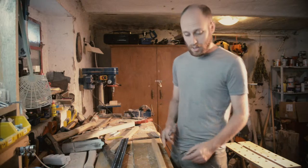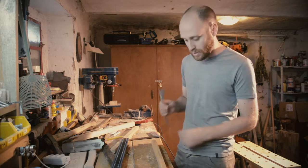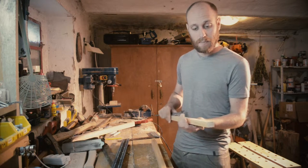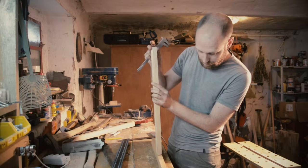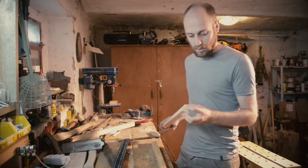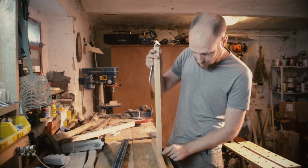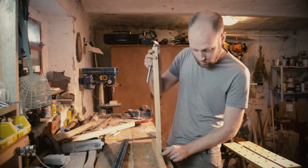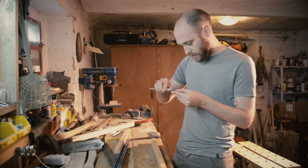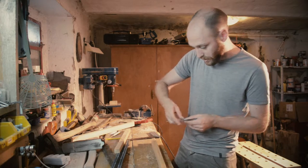Okay, we're gonna make the saw 21 centimeters deep. That means that we can cut wood of the dimension of 21 centimeters. So this piece of wood, which is gonna be our middle piece, is 3 centimeters wide. We want the holes for the nails 1.5 centimeters apart. So the first hole will be 7 millimeters from this side. I'm going to fix this at 7 millimeters.